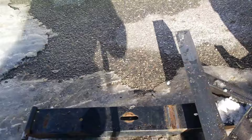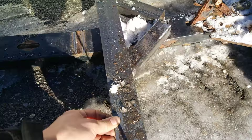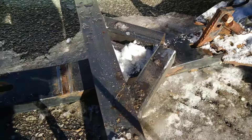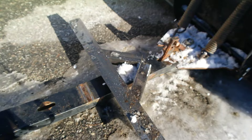What I did is I took the snowplow, I cut off some of the original mounts — you can see where one of the original mounting points was for a Craftsman lawn tractor — and I welded on this, I believe this is a 2-inch piece of angle iron, about an eighth of an inch thick. I used scrap metal that I had lying around, and I supported it with 2-inch square tubing, also an eighth of an inch thick. I welded it right to this frame, and what this angle iron does is it creates a little lip for the cutting edge of the bucket to slip right in.